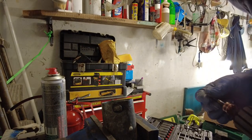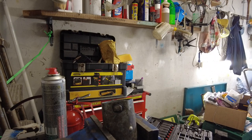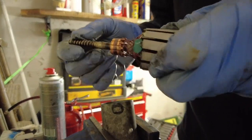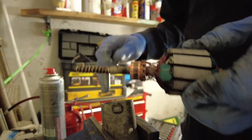If we clean and lubricate the bearings at both ends and clean up the commutator, put it all back together again we might just be in business. The first thing to do is to get a little bit of very light emery and polish up that surface there — which is the commutator. It's not a slip ring because it's a DC motor, it's a commutator. We can then lubricate our bearings. The oil did get down onto that and the motor was actually turning a bit better, but I'm still not happy enough.